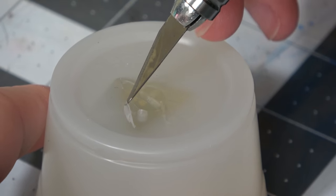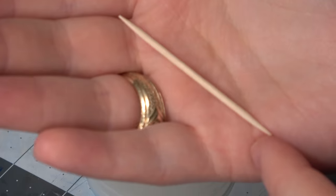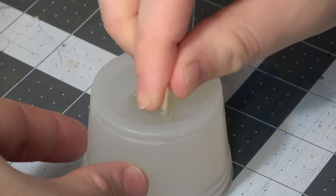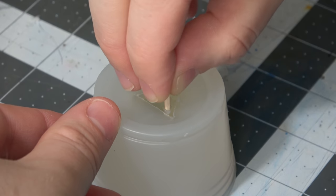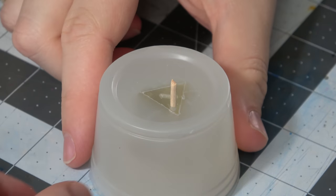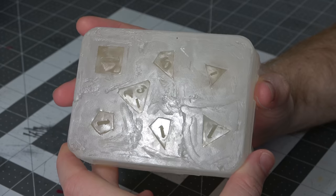For this one giant D20, because it has a hole in it from using it in a sprue style, we're actually going to try and experiment and make a sprue-cap mold combo. I think we can make something really cool here that has the benefits of both the sprue and cap mold. So I take a toothpick and superglue it down into the large D20.